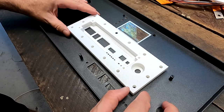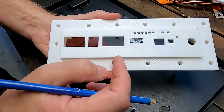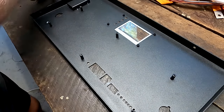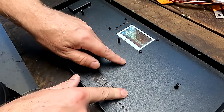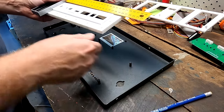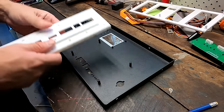The next step is a major one — we have to make the cutout in the metal front plate. This is our zero hole, so I need to measure everything from here to this corner, all the way up, and then make this rectangular cutout on the front panel. That'll be fun because I have to cut it from the outside due to all these standoffs — I can't use the jigsaw from this side. Zero and 4.5 — okay, that's our measurement. I just need to transfer this cutout onto the front panel, cut it, and we're done.